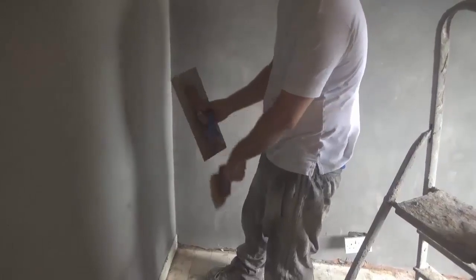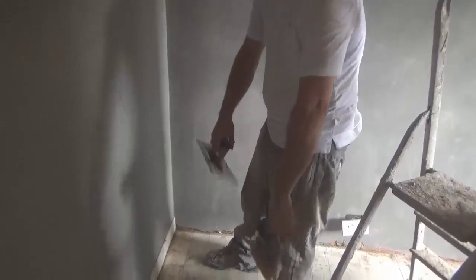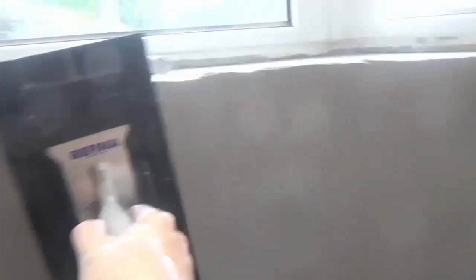I just wanted to tell you which one I slightly prefer over the other. Both have painted well and I've never had any issues with either plaster. As for the color differences: Carlite comes out a light gray color and multi-finish comes out a red-pinky color. Both set brown and then dry out more white before they can be painted.